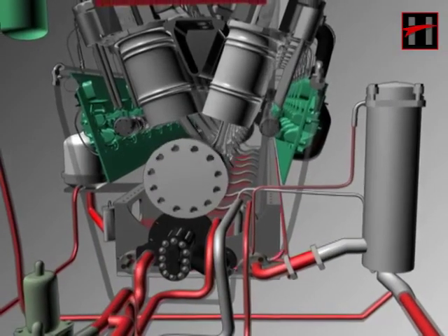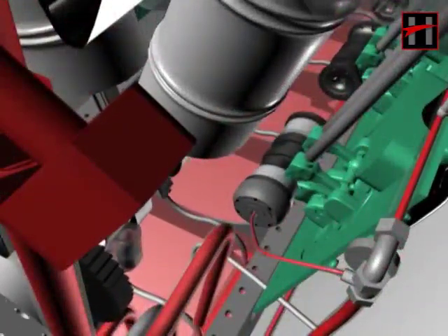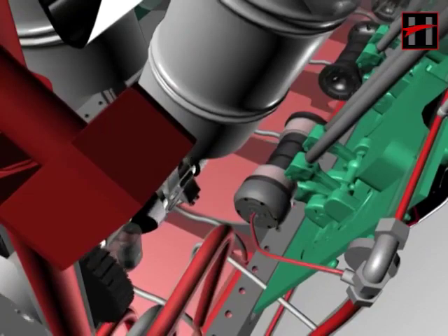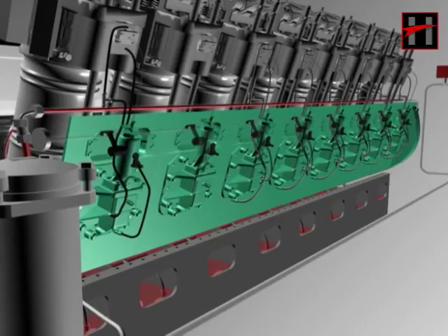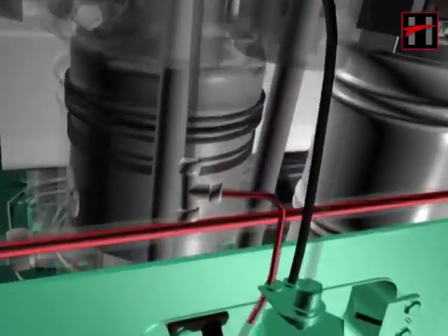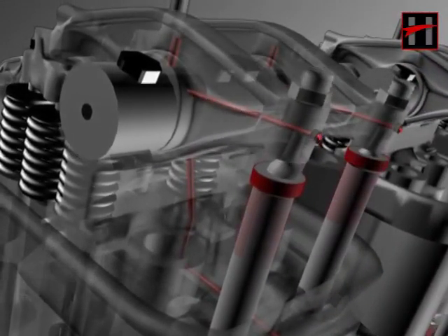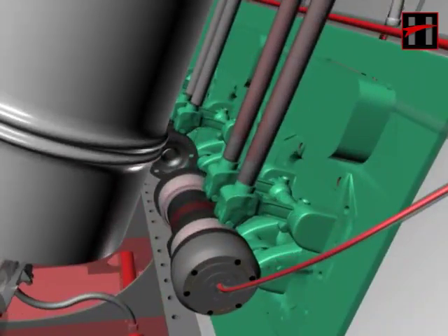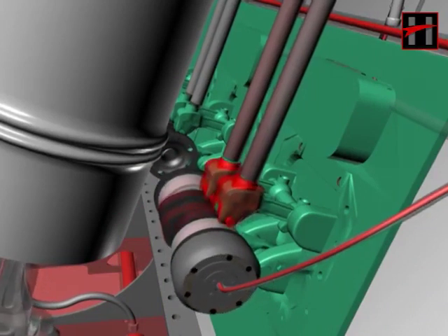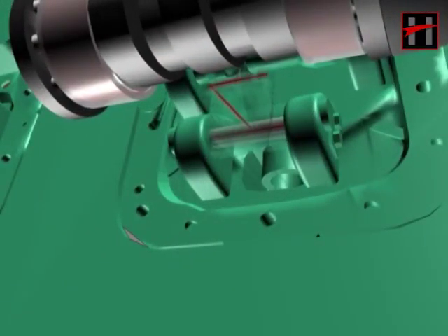The second and third branches from the main header come to the left and right side secondary headers of the engine. From there, after lubricating the vibration damper and the camshaft bearings, the oil comes to the left and right side engine block. The lubricating oil now lubricates the valve mechanism through the L-pipes via the T-connections fitted on the secondary header. It then passes through both the push rods, lubricates the cam lobes of both the inlet and the exhaust, and finally returns into the sump. From the T-connection of the secondary header, a second pipe lubricates the floating bush and the fuel pump lifter fixed on the crosshead, and then goes back into the sump.